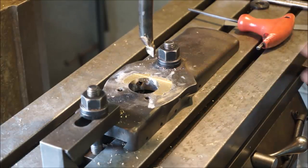If I get it real close, I do have a 1 3/8 reamer, and I can actually run that through from the other side by hand very gingerly and probably peel some of that bronze out, but I want to make sure that it's real close. In fact, actually a little flapper wheel, if that makes it work, that makes it work. I can test it with my graphite plug that I already made. We can check it out with that.